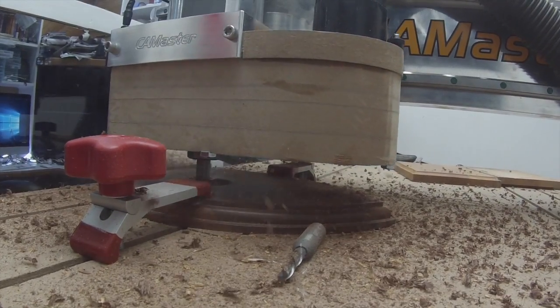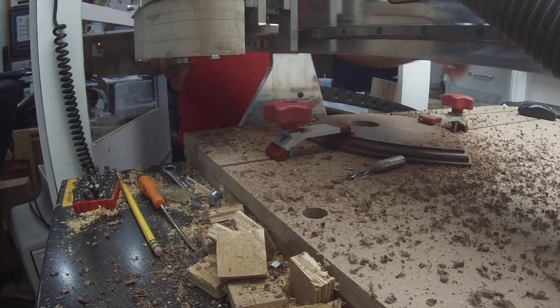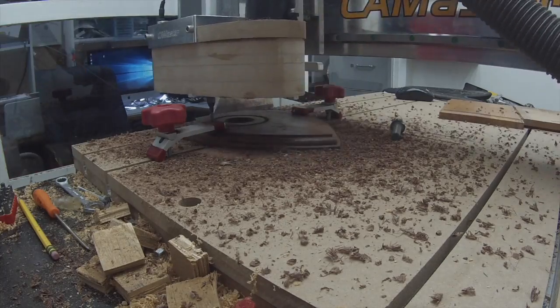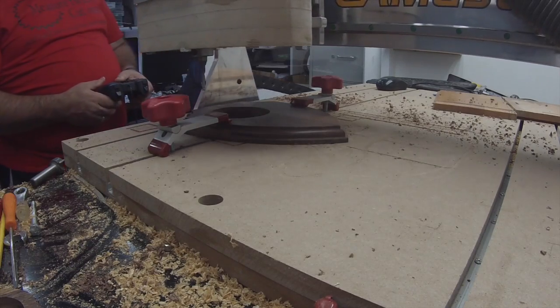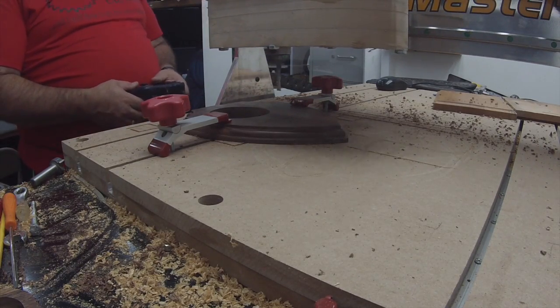1-inch dish cutter router bit for the bottom. A 10-second tool change from dish cutter to end mill, and continue. Now for my next piece, I realign X and Y, and the rest of the process is the same.